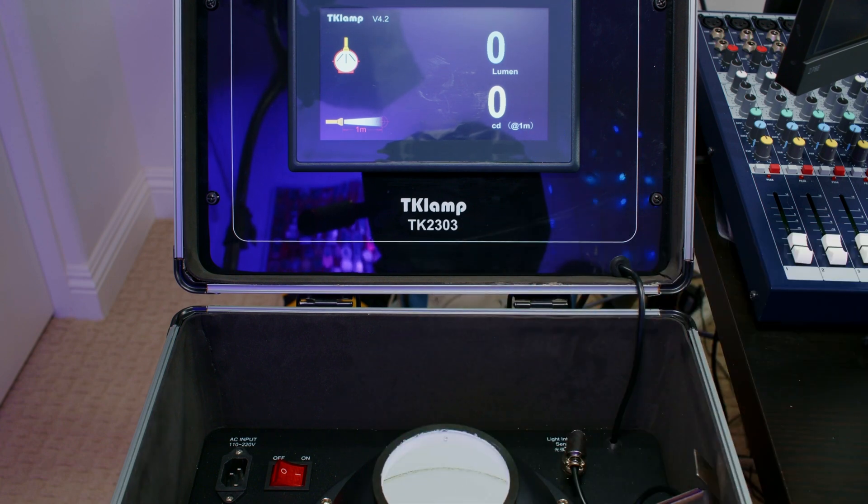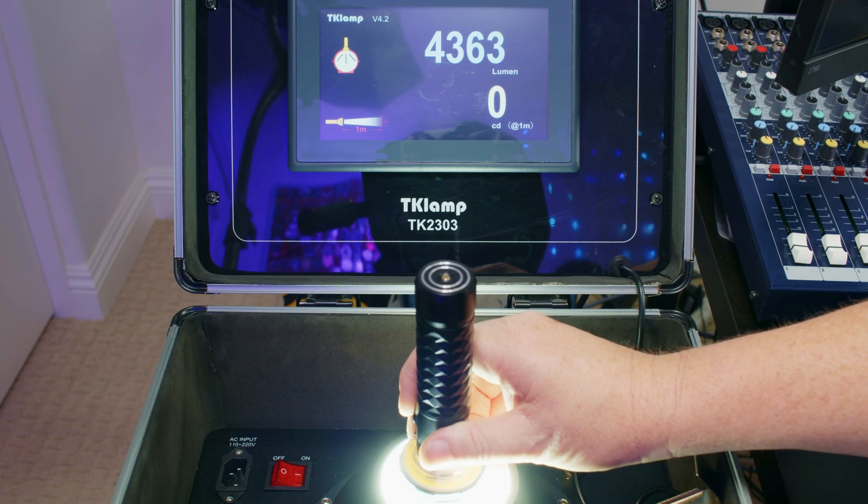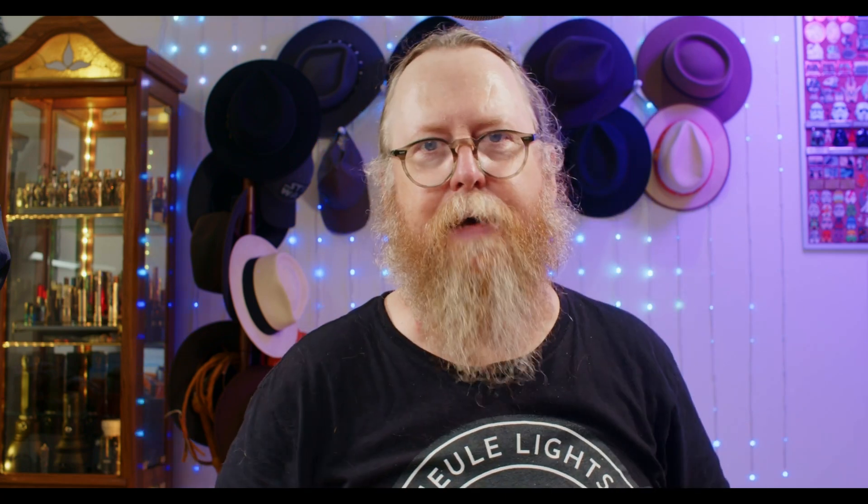I almost went out to the workshop and I realized I don't care how many lumens I'm going to lose by putting high CRI, good tint emitters in over the Osram P9s that are in here — which are max lumens and not great tint — but I'm sure somebody wants to know. So let's take a look on the integrating sphere. It hit about 4,400 up there. This isn't super scientific — there was a light gap and the battery isn't fully charged — but I just wanted to mark where we're starting. Then I'm going to swap it and measure tint and lumens when done.